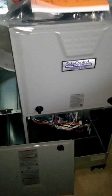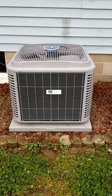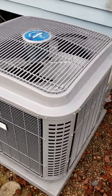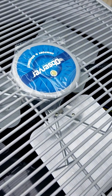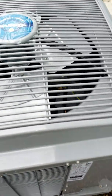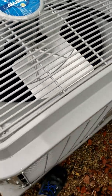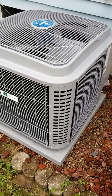Probably do another video once it's all started. Here's the outdoor unit. This will be our Constant Comfort 16 SEER — it's the upgraded model. It has a compressor blanket for sound, high and low safety switches, and this year they made a change so it'll communicate. Now it has communicating capabilities, so we're going to put the ION stat in and have a communicating system.